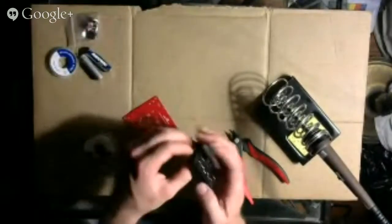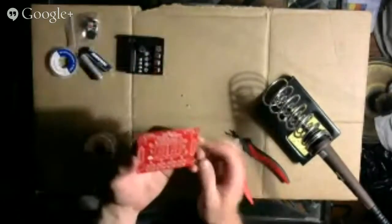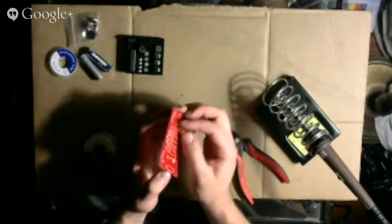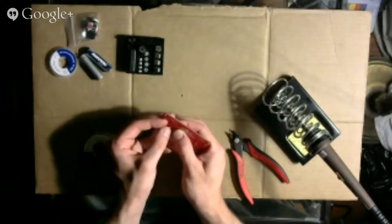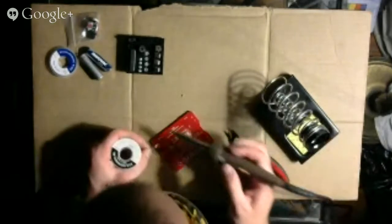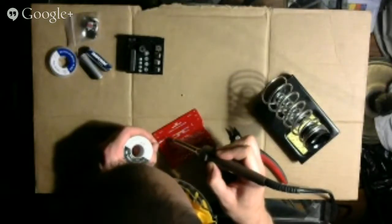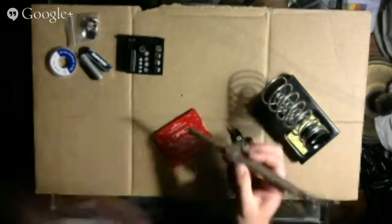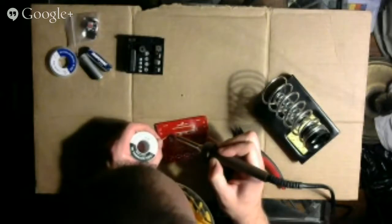Locate the two capacitors right here. Here's one of them, and here's the other one. Find these two spots for the capacitors on the printed circuit board. Stick this one in like that. Bend the legs on the other end so it stays in place. Easy enough. All right, same drill. One Mississippi, two Mississippi. Okay, next one. One Mississippi, two Mississippi.